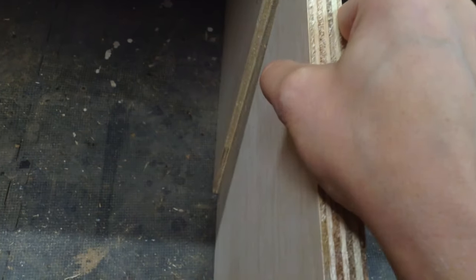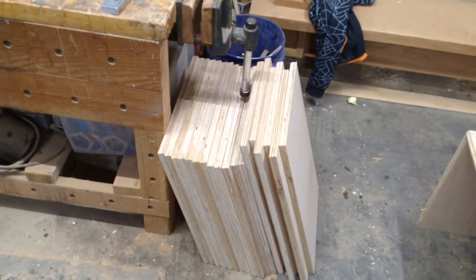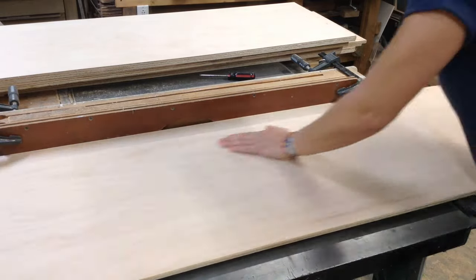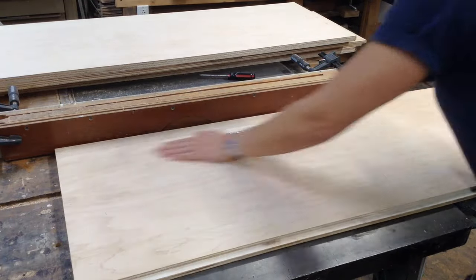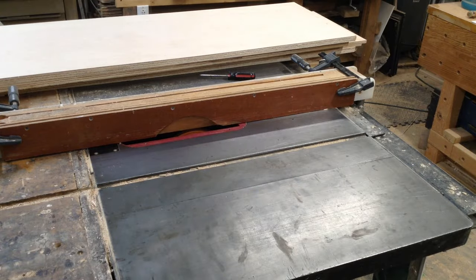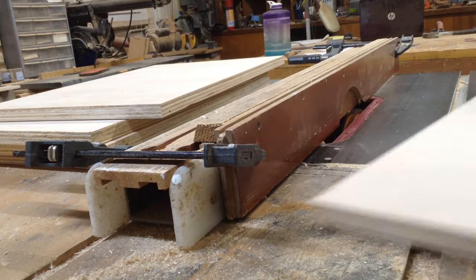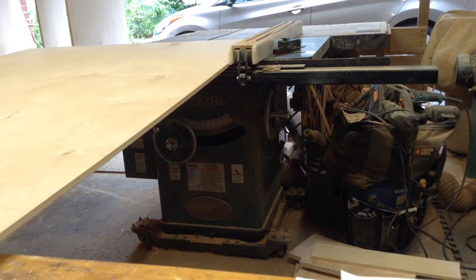The middles are trimmed by half an inch so that they hit the backer. I already cut that groove on the bottom — ideally you can do this all at once but I built these in two sections so I made a test piece of that groove to make sure it would match on the top, and then I could cut all the identical grooves in the poplar. Once I had that set up I could just cut all these — I have my entire stack of pieces and it's just a matter of sending it through, flipping it, and sending it through again. On the longer pieces the quality of plywood these days is not great and it's pretty warped, so I send through the longer pieces twice because you want those grooves to be perfect the whole way through.